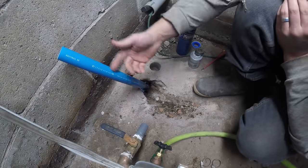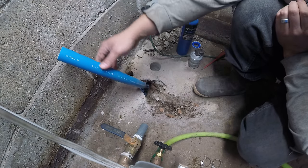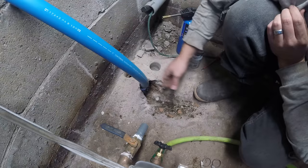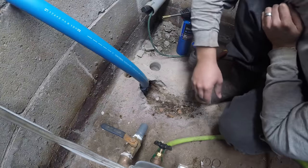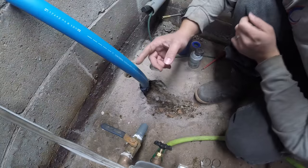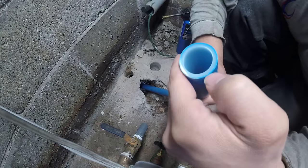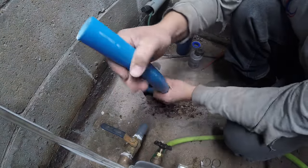I just want to talk about this pipe a little bit. If you're going to be installing a pipe for a well or a water line, I would highly recommend going with a better grade pipe. You can get 100 psi stuff and 150 psi stuff, going all the way up to what we've got here. This is a 1 inch HDPE 250 psi pipe. You can see how thick the edges of it are — it's not quite a quarter inch but it's pretty close to a quarter inch of wall thickness. High quality product, but it is a lot stiffer than the cheaper stuff.